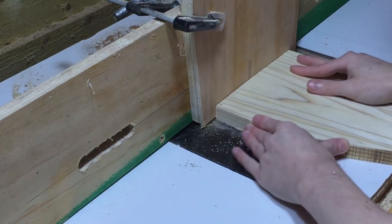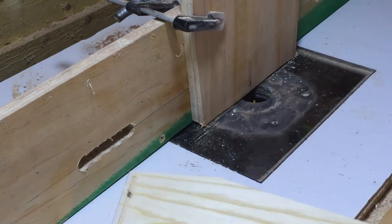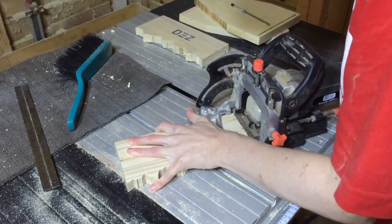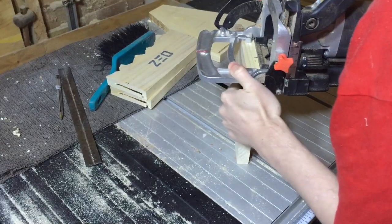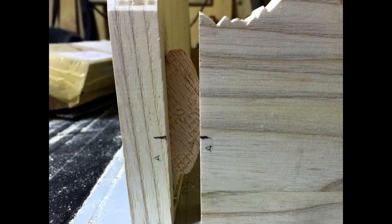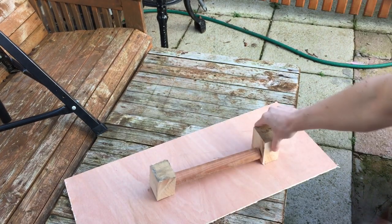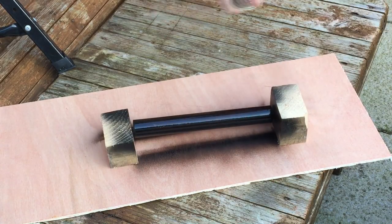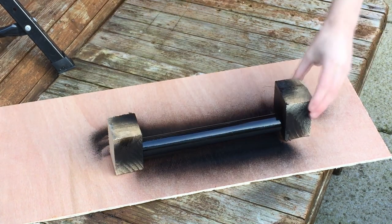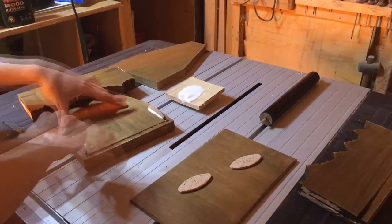I made a stop groove — you wouldn't see it while it was constructed together — but it's to receive a 5mm plywood base. I used the biscuit jointer to connect the shorter sides to the taller sides, and that's what it would look like going together. I used a piece of curtain rod with some dowels on it and spray painted that black.